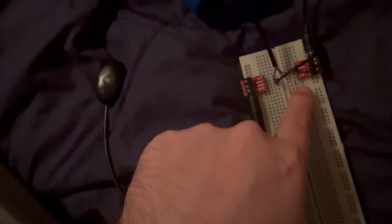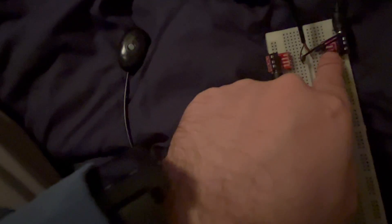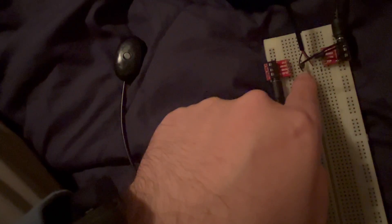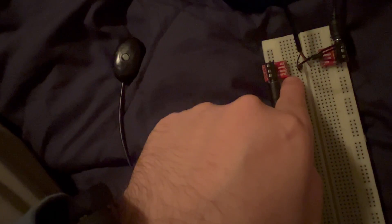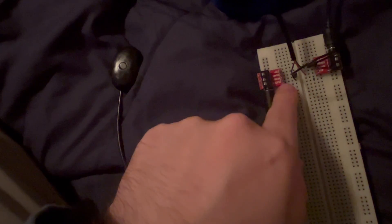It's a very simple wiring. First, this audio cable comes in. The audio wires connect straight to this jack. And this black wire, which is the remote control signal in and also powers the backlight, is connected to pin 4 of this jack. And the grounds are connected together.